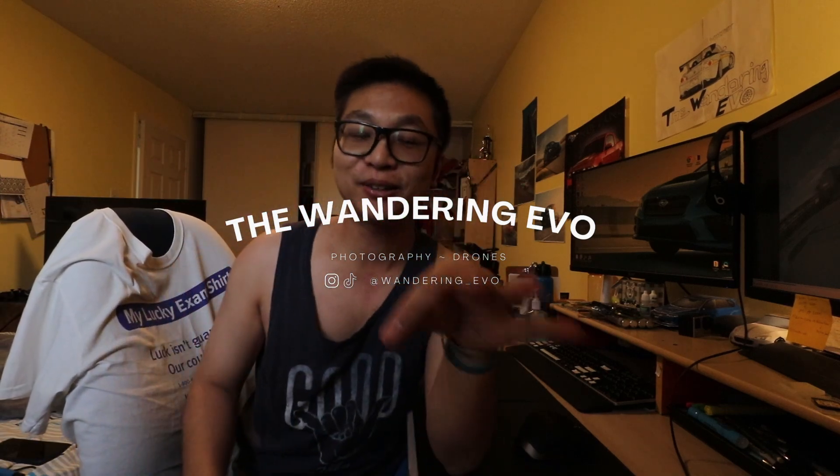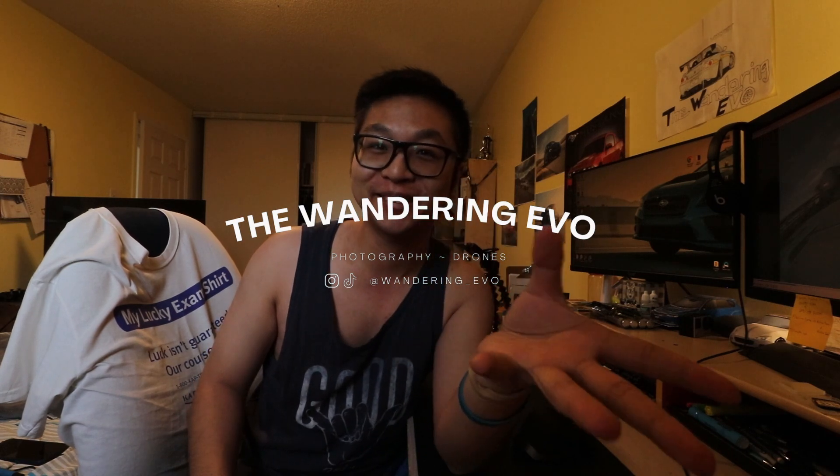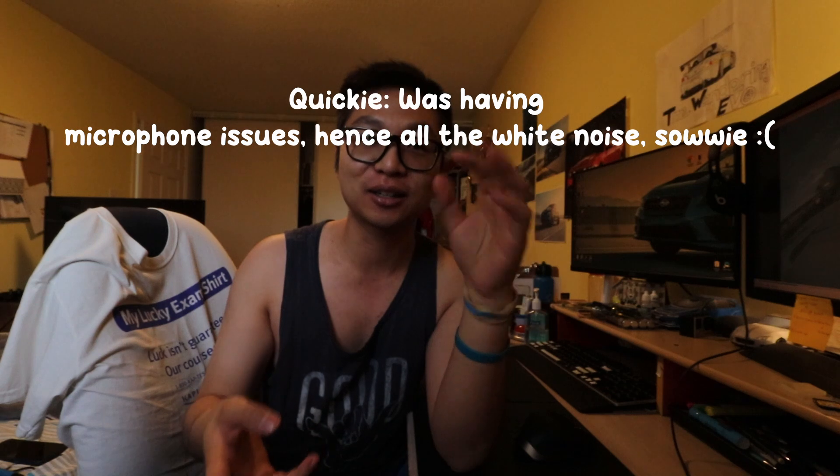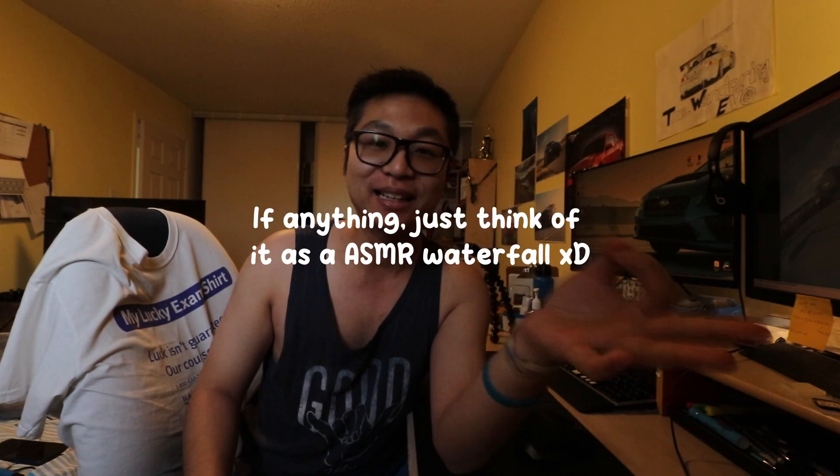I know it seems like I've really just been posting repair videos, but I've really been flying a lot more than I've actually been posting, so there's gonna be a lot of catch-up. Today we kind of broke the Nazgul — that happened like a couple weeks back. We were flying really well, last pack for the day, and the Nazgul's ESC just decided to give up. This is what happens when you plug in a battery — normally you'll hear startup beeps, but unfortunately we got nothing, which means the ESC is dead.